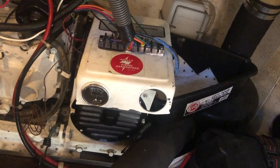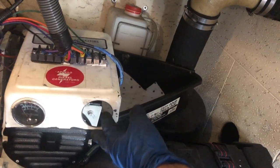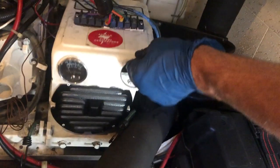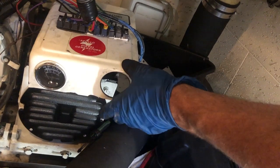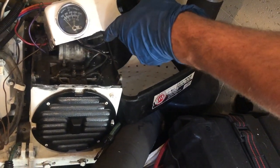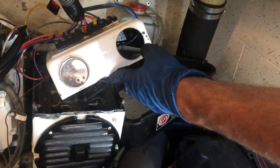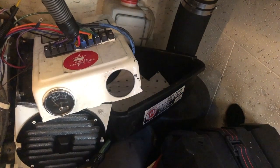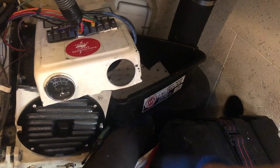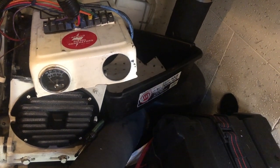That cover has been a problem since I bought the boat. All the screw holes — the metal has fatigued and broken through, so I actually hold it on with a bungee. What it really needs is a nice thick rubber piece of trim to keep it from vibrating and resonating. It makes a racket — it's actually the noisiest part of the genset. I'd love to replace it with something better. Really, this control panel needs to be isolated from the engine alternator setup. I don't know what I'm going to do there. I have a new gauge, but if I install it in that same slot, the same thing is just going to happen again.